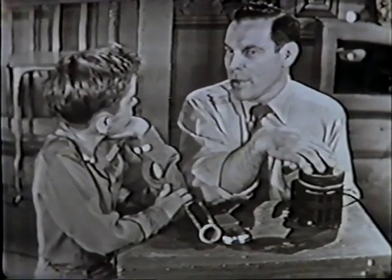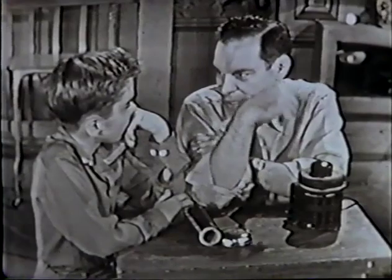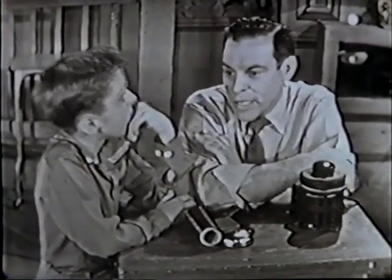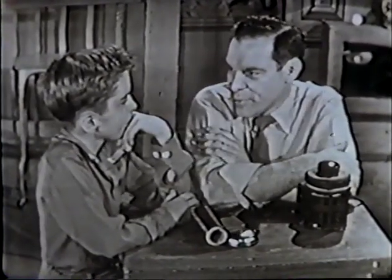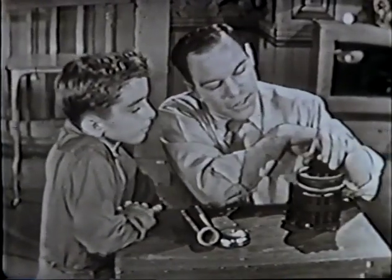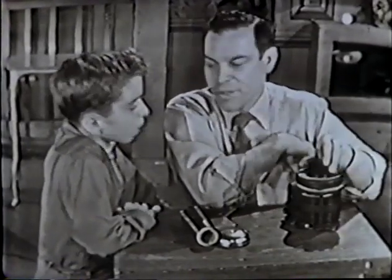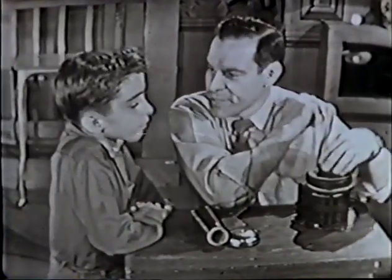Something like a rheostat? Well, it's kind of like a rheostat, but a rheostat adds more resistance. In other words, you make electricity go through more wires, and it prevents the electricity from going through, kind of like building up blocks on a dam to prevent something from coming through. But this time, we have a fixed number in our primary, and we can vary the number in the secondary.